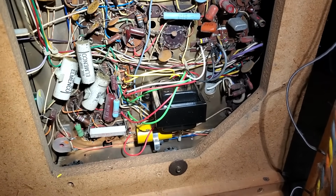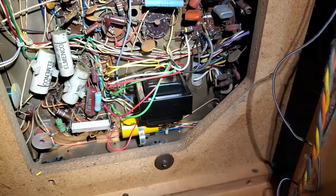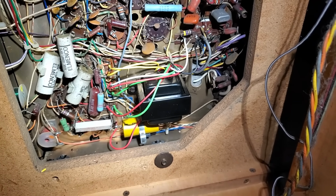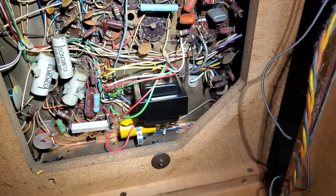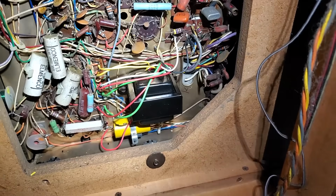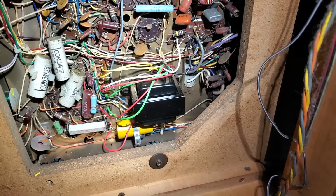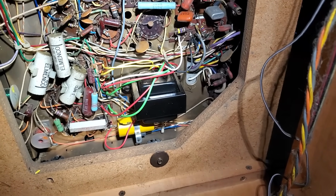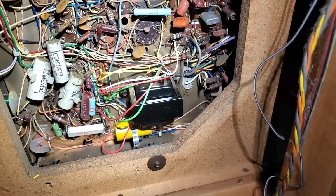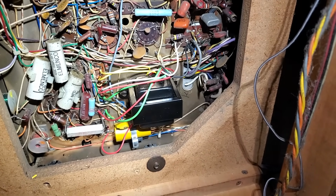So I'm tempted. Also, talking to Marco, I could easily open this transformer and split those two coils, slice the tape, split those two coils, and add a fourth wire, and then tie them together in whatever configuration I wanted on the bottom. That's how we should have done it. Because we weren't 100% sure on everything, we should have just brought out another wire. But like he said, they're wound in this, I think he calls it bifilar thing, where the coils are basically laid right next to each other, the two wires. That way they're exactly even.